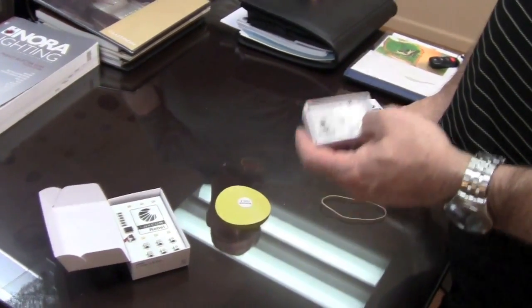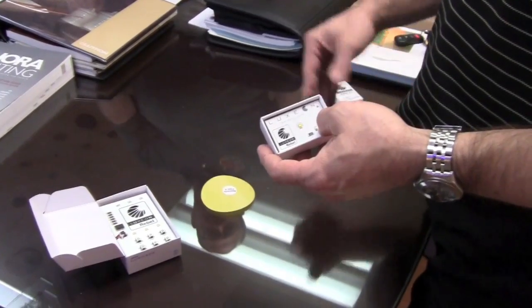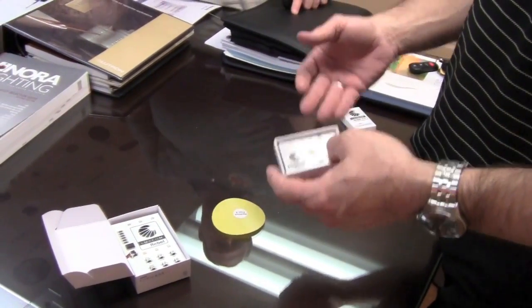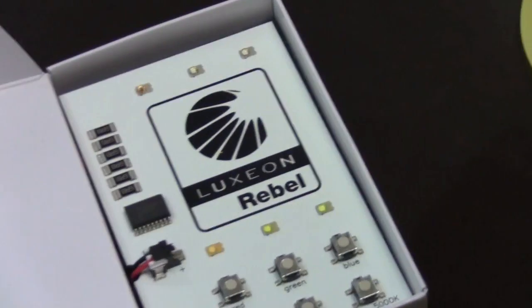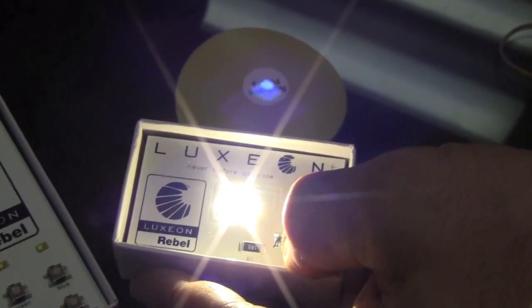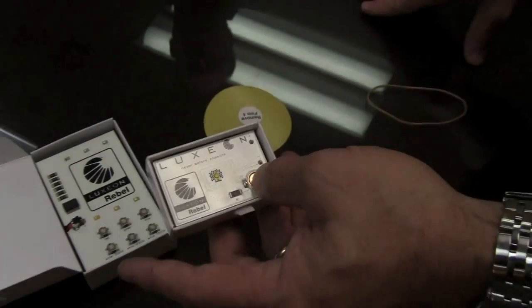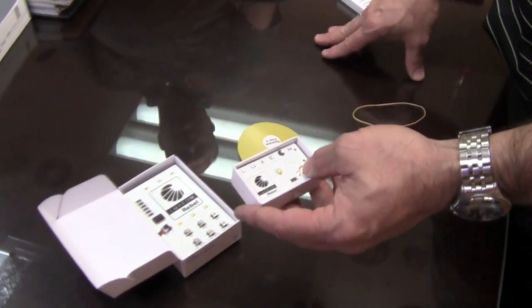So one method to get a white LED is you take a blue LED, a pump, or blue pump is what they call it, because it's the most consistent color control off the wafer in the manufacturing process, and then you put phosphor directly on it. In this case, this has a phosphor directly on the LED. This is a blue LED, believe it or not, and it changes it to whatever that lamp color is. I think that's 4100. Yeah, I'm blind here, I looked right at it.